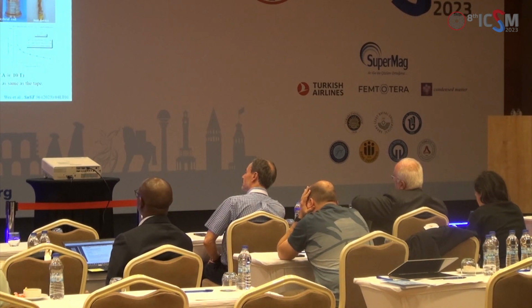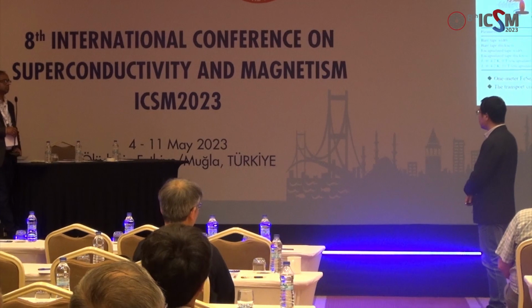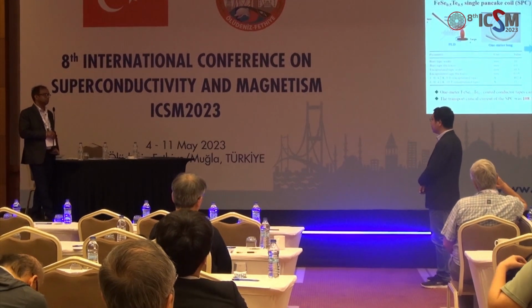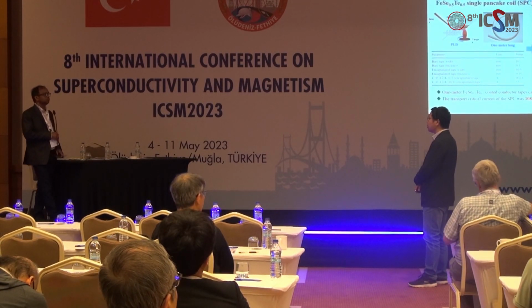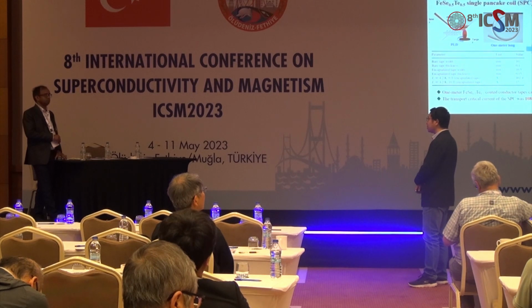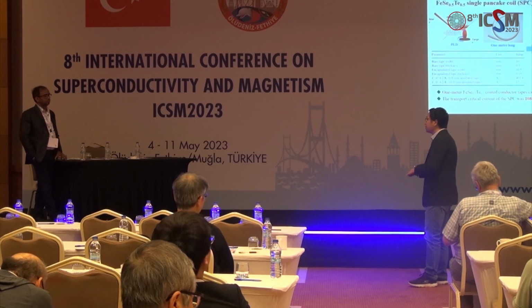So 122 is the best choice because for 122 it is very easy to fabricate high purity precursor powders. We also tried the 11 system, the iron selenide, but iron selenide reacts with nearly every kind of sheath material. I also tried the 1111 system, but the 1111 system cannot fabricate high purity precursors. And for the 1144 system, they are not stable at high temperature. So with low temperature sintering, the connectivity between the grains is not very good.